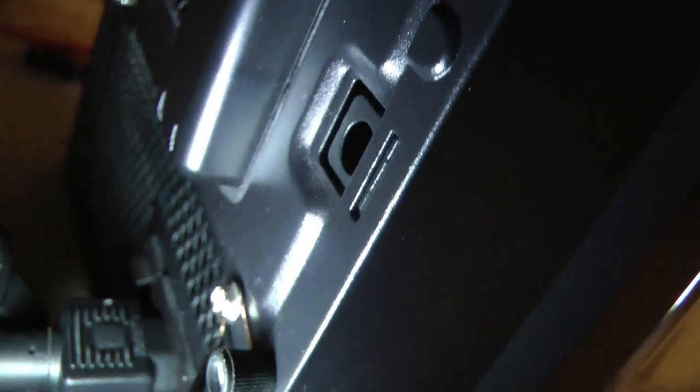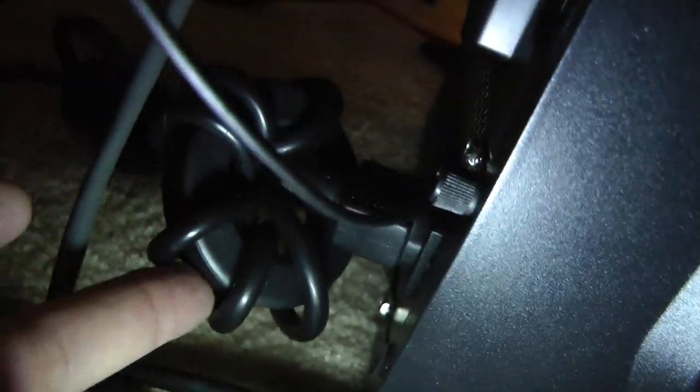Also, at the same time, I put this big doughnut — or toroid core — on. If you see this little black wire coming here, I put this on to the screw that goes on to the power supply, right there, the silver one. And I don't know if it's the ground wire, but I'm pretty sure it was probably the toroid with all these windings close to the plug itself. I think this is what isolated the noise to the 7300.